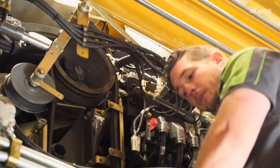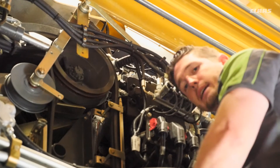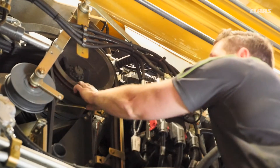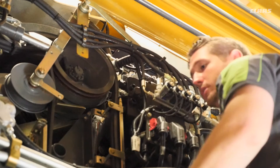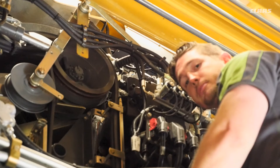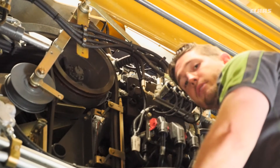I'm on the left side of the machine here and I've used my service ladder so I can access the transfer gearbox area. On the transfer gearbox, we have a pulley mounted. This pulley is designed to provide airflow and cooling for the transfer gearbox. We want to blow this pulley out every 10 hours.